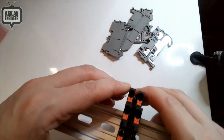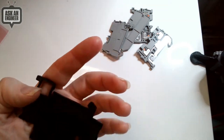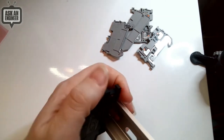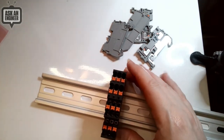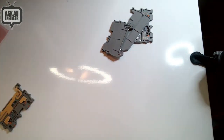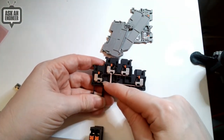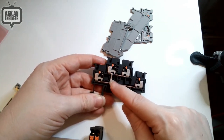Here are two terminal blocks — I slid them side by side, and you can slide more on. This is the connector part and you hook it on. Once you do this it's kind of hard to take off — you have to slide it off. It snaps in and you push it onto the end. Now you've got three terminal blocks, three distribution blocks. They come in different sizes — this is the smaller version. This one is a distribution type: these four — two connected together, two on one piece of metal — with a big hunk of tinned copper connecting between them.